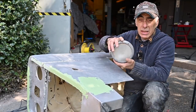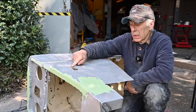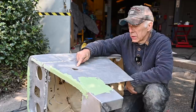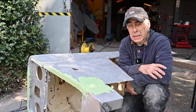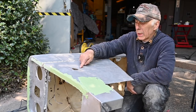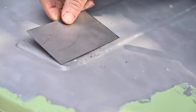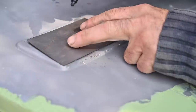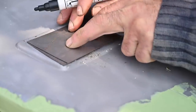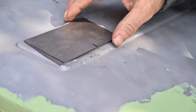I've taken these lights off because I have new lights for this, but when I took them off I noticed that this area right here is really worn out. It's too wide as well and it's kind of rusted away - they already had a washer in the back. So what I'm going to do is cut this out and then put another piece of metal in it. The polyester putty is still drying, so meanwhile we'll weld up this little area. The way we're going to fix it is by cutting out the area and welding in another piece of metal. I'm just going to check if this piece is going to fit - I think it will. I'll cut it right here.